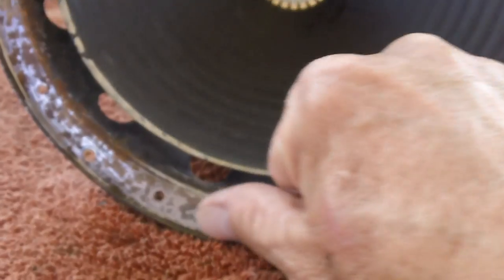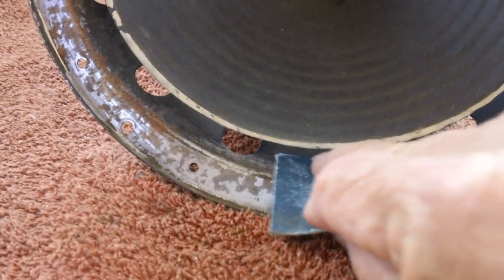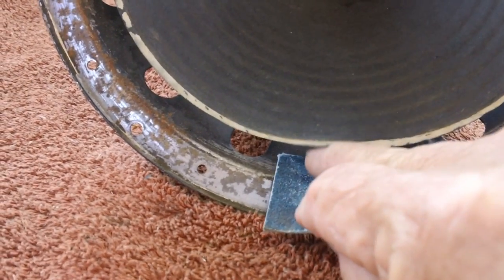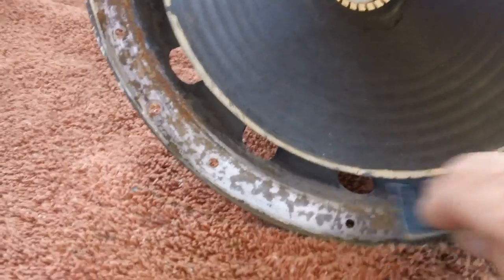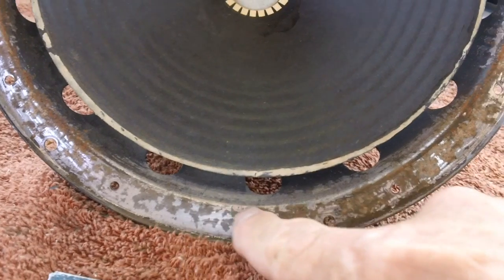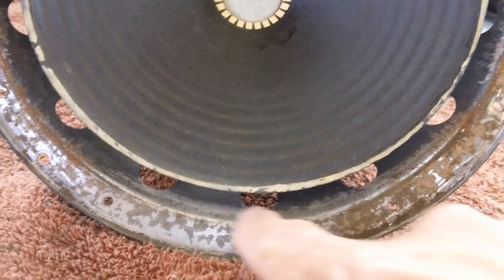I'm not going to go down into the metal real deep - just until it's nice and smooth, you can feel it with your fingers. Then up in this area, I'm also taking the emery paper with my finger as a buffer between this bigger cone so I don't mess that up. I'm just going to knock off all that rust as far back as I can get it using the emery. Once we get it all done, we'll take some naval jelly and put it down here with a Q-tip, nice and easy, and then wipe it out with a damp cloth later.